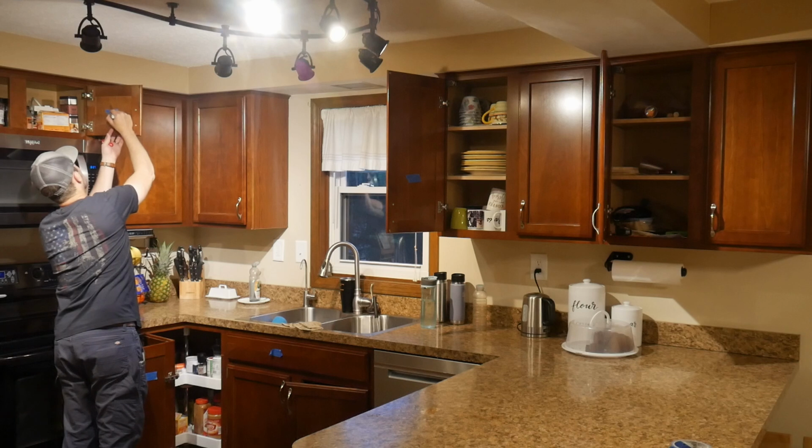So 7 years of using this kitchen pretty much all day, not even just 3 times a day, it has some wear and tear on the cabinet doors. Some of the finish has worn off, so it's time for a refresh. What we're going to do today is take all of the door and drawer fronts off, get them all cleaned up. We're going to retone them, and then we're going to shoot multiple coats of General Finishes 2K polyurethane on top of these, revitalizing them hopefully for 7 years or more to come, when maybe it is time to finally redo this kitchen.